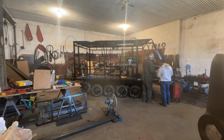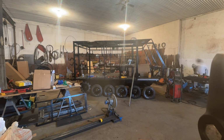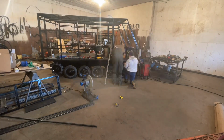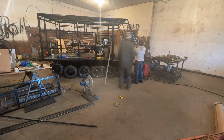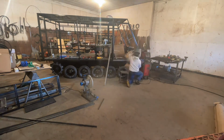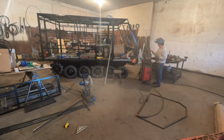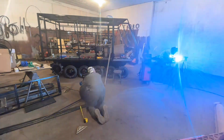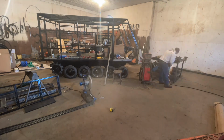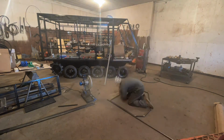So as we're working on the doors there, I decided with the door jambs being in place, we could measure up and get all the doors themselves, kind of tack them in place inside the door jambs. So we knew we had a perfect space all the way around them, and they wouldn't move on us as we were getting those all fitted into place. So that turned out to work really well for us.